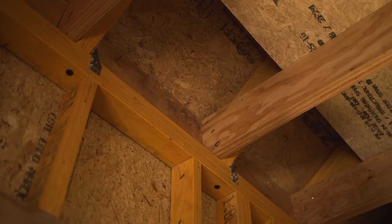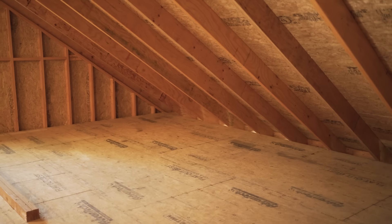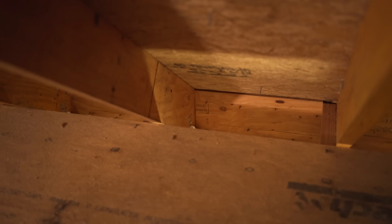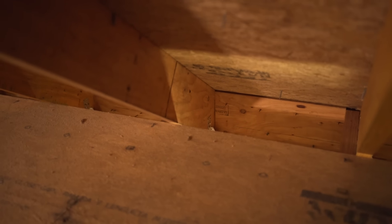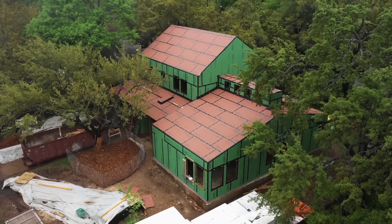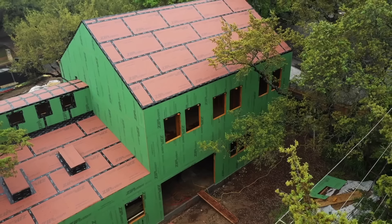What I like to do is design that lap connection where the ceiling joists are lapped over a wall to have enough strength to resist that tension force, and then rely on the decking as redundancy in design. Redundancy is a good thing - we're going to have the floor decking anyway, so we try to take advantage of that.